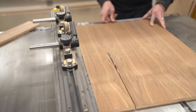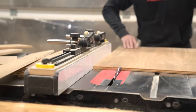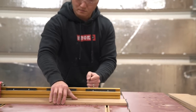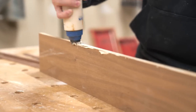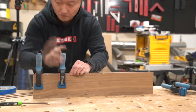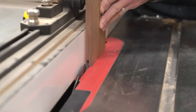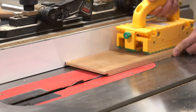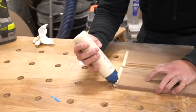Okay, drawer slides in place. Now let's break down the half-inch plywood for the drawer boxes. And even on drawer boxes, I don't want plywood edges to be showing, so you know what's next. Okay, the edges are looking fresh. Now let's cut the joinery. I'm going to cut everything using just a single blade at the table saw. That was easy. Now let's glue everything up.